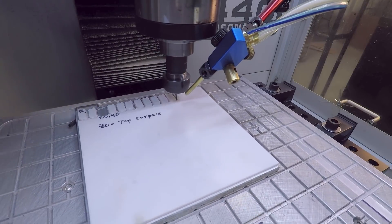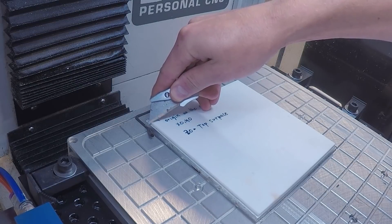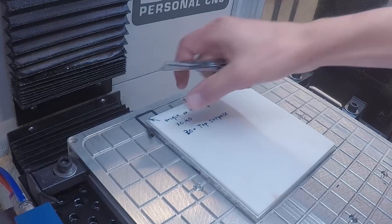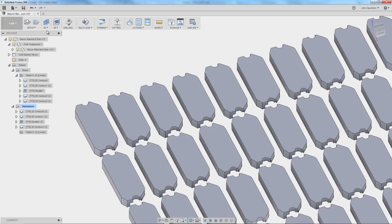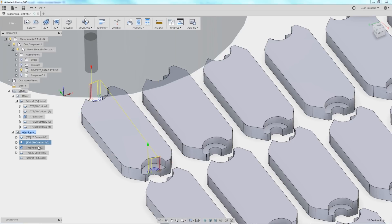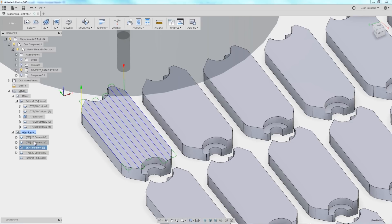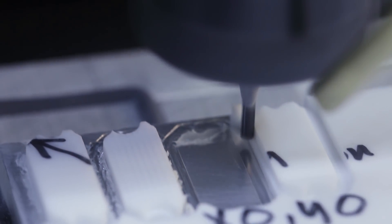We machined these parts out of a ceramic material called Makor back in Widget 170 — one of the most difficult parts I've had to make. Makor is not a fun material to machine; it tends to chip and these parts were very small. We made use of part density by machining a number of them in a larger sheet of Makor material. We were very deliberate walking through the Fusion 360 toolpaths — roughing, profiling, where to leave tabs and stock — to ensure we didn't cut through the floor and lose vacuum, while getting as close as possible to producing the finished part reliably. If doing this type of work, first deck your vacuum chuck so your Z level is constant and perpendicular to your spindle, because even a few thousandths of an inch variation across a large area can cause you to lose your vacuum.